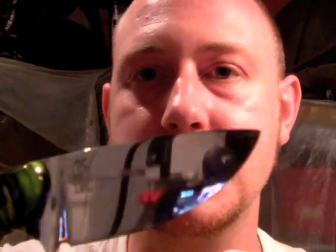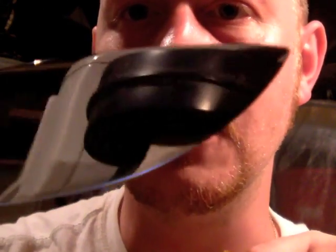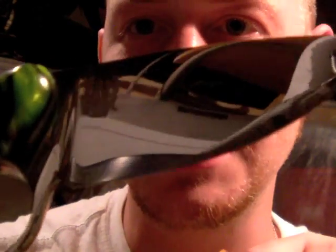I said this about the last one, that it was the sharpest knife I made, but the last one wasn't a full height flat. Even though the blade was deeper, the full height flat on this is actually higher than the flat was in the last one, so it's actually leaner. And I don't know if you can see, but it's my first micro bevel. I hand sanded this,